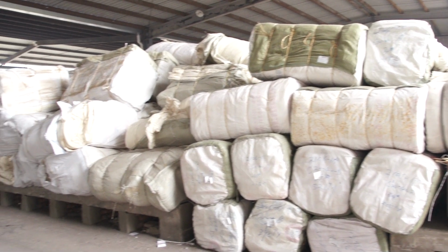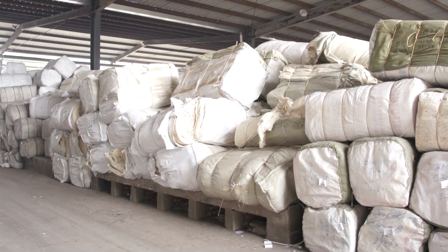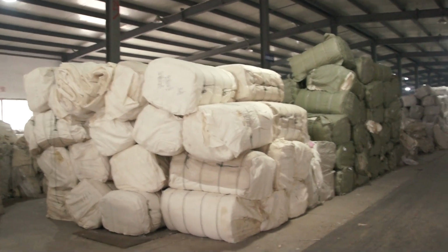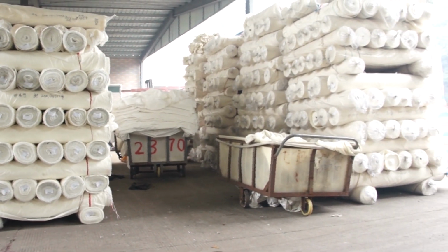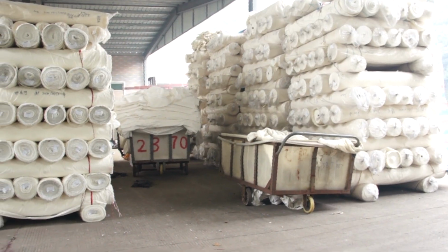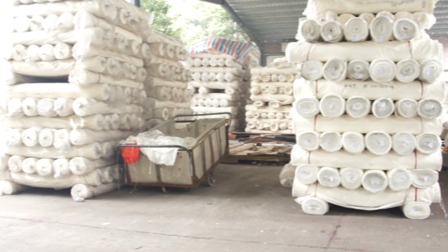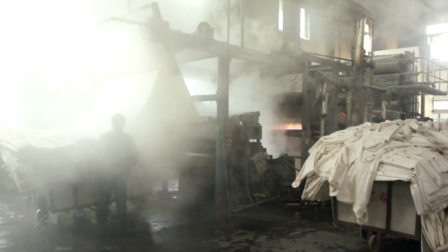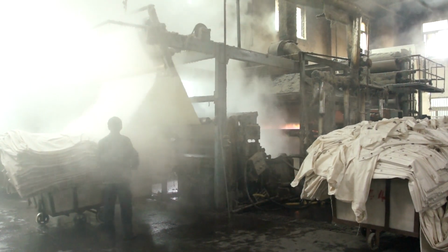To begin printed fabric production, you start with what is called gray goods. Raw cotton yarns are woven into the fabric, and after weaving, you have produced a very stiff and dirty product. The fabric is stiff due to the starch and sizing used to stabilize the yarns, and it is dirty since the fibers used to make the yarns have not been cleaned or processed. The gray goods are delivered to the print plant either in the form of square bales of folded fabric or on large rolls that contain 120 to 250 yards of fabric.